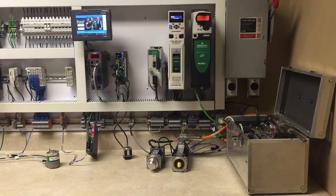Today's demonstration will be with the Trio Motion Controller MC4N EtherCAT Master. This EtherCAT Master is a high performance motion coordinator with up to 32 digital drive axes available. The MC4N is able to communicate with drives over the EtherCAT network, which is supported by over a hundred different drive manufacturers.